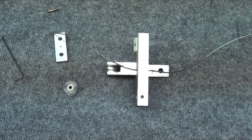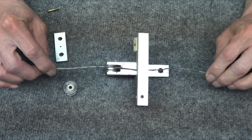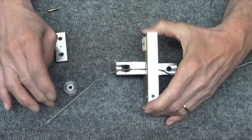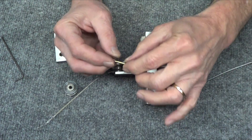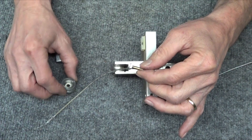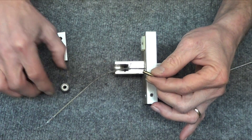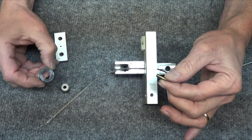Really shocked at this — look at this, this is a stainless steel cable. This thing frayed in an aluminum hole. Pull the bearing out — this is the brass pin that I had made that just goes in there and I can actually feel it. It is slightly worn even though there are two bearings right there. I'm going to have to grease all this stuff up and put it back together, but at least you guys can see what it looks like.